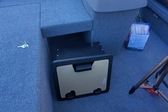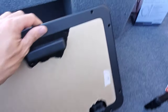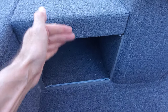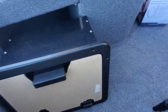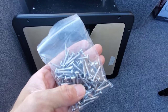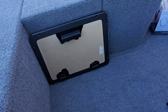Now with that in place, the last thing I need to do is permanently mount the built-in tackle storage box. To do this, the unit comes with pre-drilled holes. We've got our framing picture-framed around and at the top we're going to tie into the wood lip — eight holes, eight screws. These are countersunk for a nice flush fitment for the screw heads to attach. I'm going to use one-inch stainless steel screws from Amazon, drive them through, get this where I want it and just tie it down — that's all there is to it.